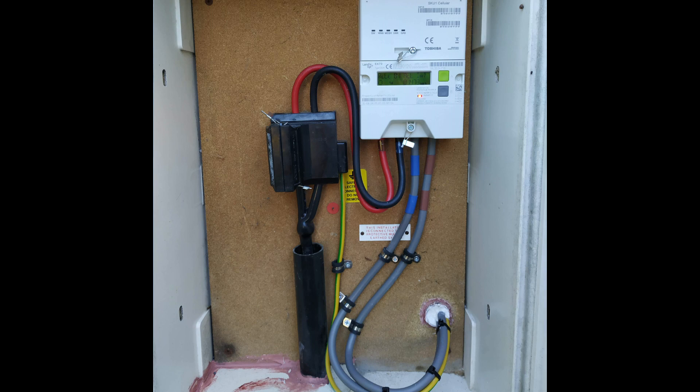Subsequent to changing all this, it turns out the main fuse was actually a 60 amp version, so those particular sizes of cables would be okay — however they're not okay because they're going through the insulation. Here's a picture of the end result when all of that's been replaced. We've now got 25mm² cables going in, primarily so that in the future if additional equipment is fitted such as an electric car charger, they're also the correct size for that. Note that they no longer go through the cavity wall insulation — there's now a duct pipe put through the wall so they go straight through to the other side.